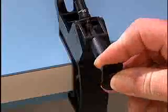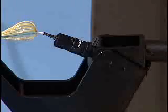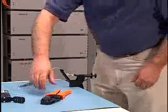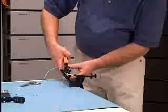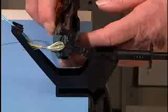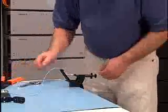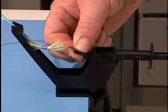Press the plunger on the installation tool and hook the release wire on the connector. Slowly release the plunger. Push and rotate the connector one quarter of a turn in a counterclockwise direction — this action will unlock the connector assembly from the installation tool. Rest the crimping tool on the connector body to aid correct alignment. Using the first die position on your crimping tool, strongly crimp the stem of the connector assembly. Re-insert the connector body into the installation tool and push and turn a quarter of a turn in a clockwise direction until it locks.